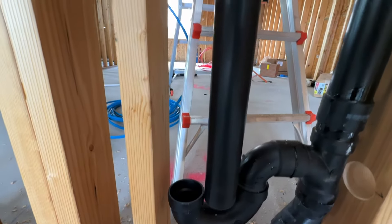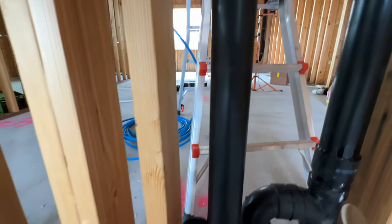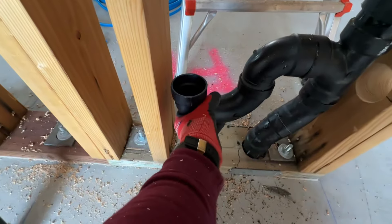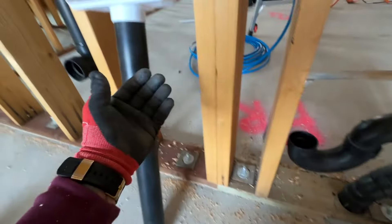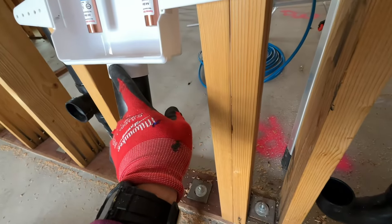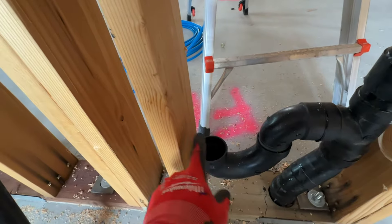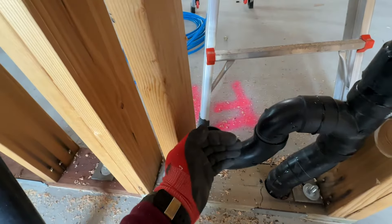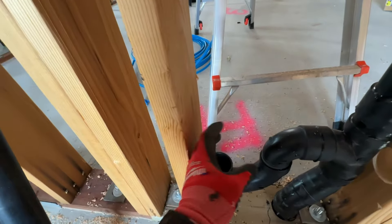We'll do one 20-degree joint at the bottom and then if we have to, we'll do a small piece in between and line it up depending on what we need for the spacing. We have basically a 2-inch offset, and I also want to make sure that wherever I set this P-trap it's not too far in or too far out so that I'm not trying to bend this — it's only about an inch back. If I were to center it, it would be almost 2 inches on center. So I have this P-trap joint slightly turned so we can be the proper depth into the wall and then we'll jog it over to line up perfectly with the box.